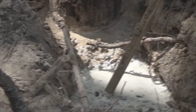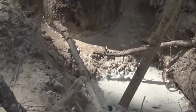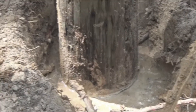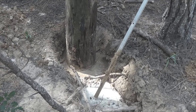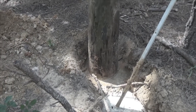All that water that you see in there, that white creamy stuff — I put the mud that I dug out of the bottom. The bottom three and a half feet of mud is back in there, and I put water into it, and I've been mixing it with this stir stick, just working it up and down like settling concrete in order to get that clay to adhere and hold this pole.